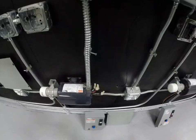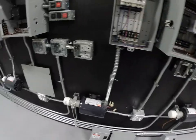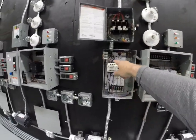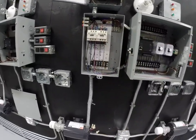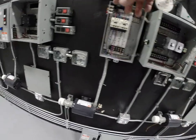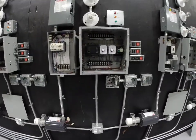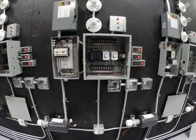You will have more on this motor, so when you get back to the lab, you'll be wiring these up. You'll be pulling wires all the way through from the load side of the disconnect, through into the line side of the contactor, then off the load side of the contactor, and back into your motor — and we'll have that whole sequence work quite well. Hopefully you got a little bit out of that. I'd give you more on the nameplate, but that's for another lesson. Right now we're just into the taps, so see you on the next video.